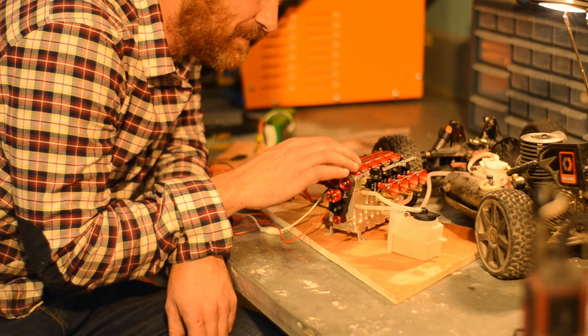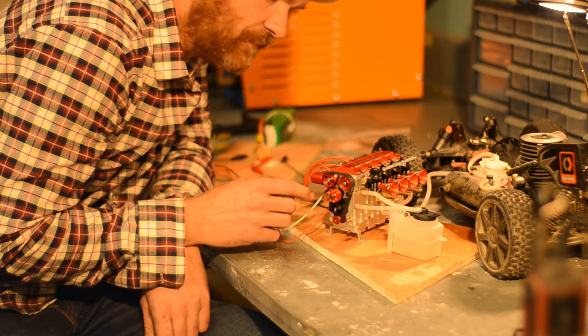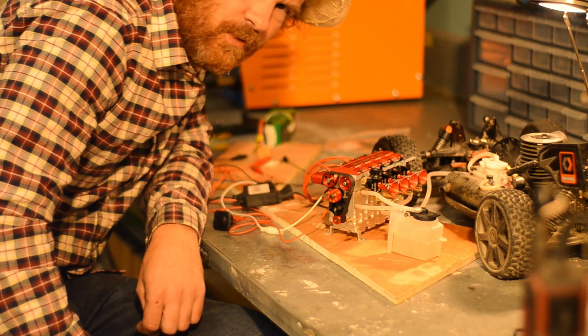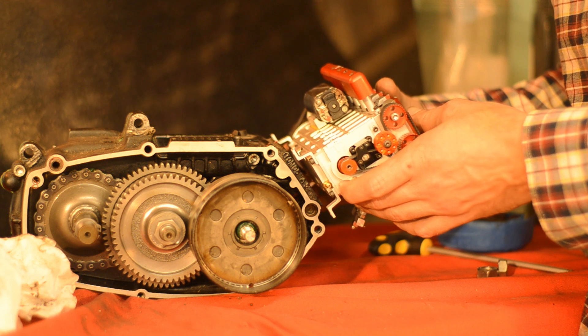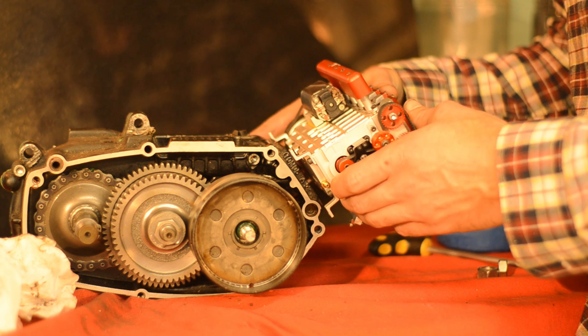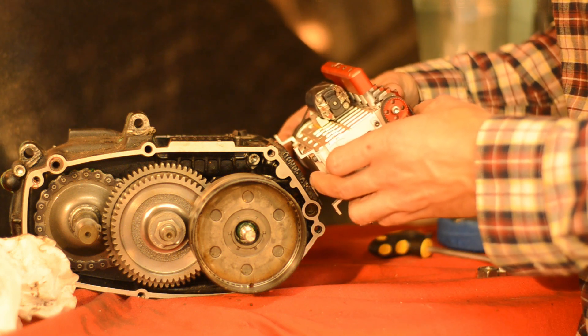I think the sound of this will be awesome in a moped. Let's hope the crankshaft doesn't break — it's only supported at each end here, and many have broken them. Simple plan: I'm just going to make an adapter plate and fit the engine like this. Belt or chain drive and reduce it two to one. Take some measurements and make that adapter plate.